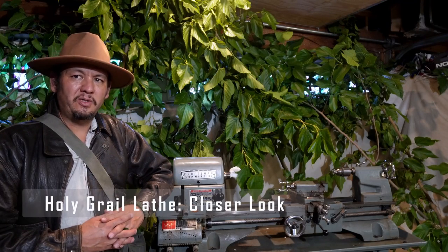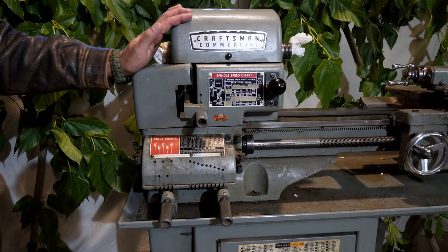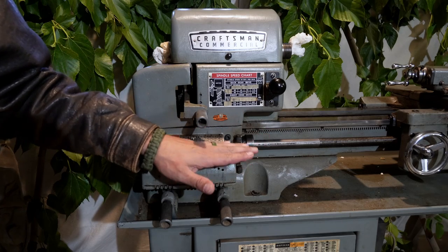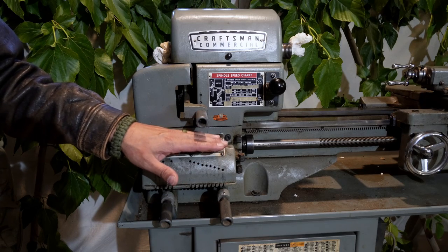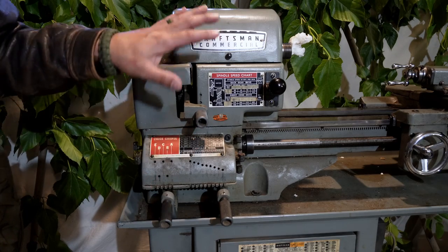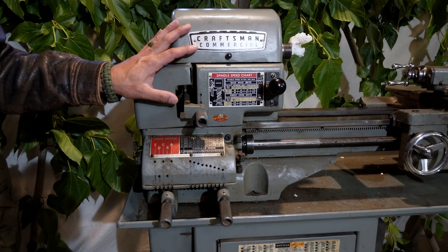They say the devil is in the detail. Now let's take a closer look at the stats and what makes this lathe so sought after. Here you can see the headstock, and this provides a good view of how it interacts with the bed. As you can see, there's no riser or any kind of riser blocks indicating that it was some sort of conversion that moved a 10-inch headstock up an extra 2 inches. This is an entirely separate and different headstock unit from the 10.